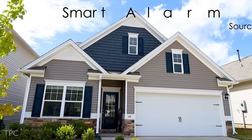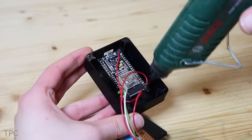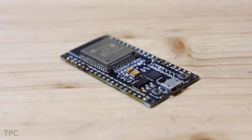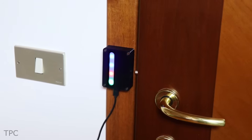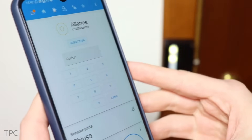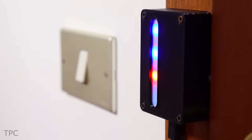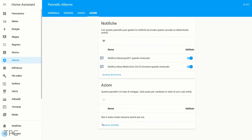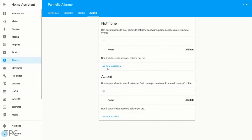Number 10: to protect your home from intruders, an anti-theft alarm system is essential. If commercial options are too expensive, you can take a DIY approach like Giovanni. He used an ESP32, a magnetic reed switch, addressable LEDs, and other necessary components to create a secure alarm system for his house. A passcode is required to open the door; otherwise the alarm gets triggered. Each movement activates an LED sequence and also sends a notification to his smartphone. He used the ESPHome framework to operate and monitor the alarm, allowing him to easily modify other security parameters.